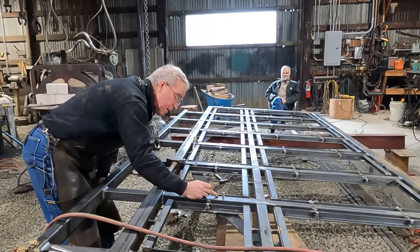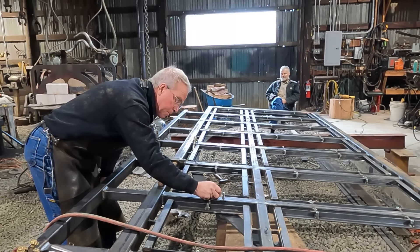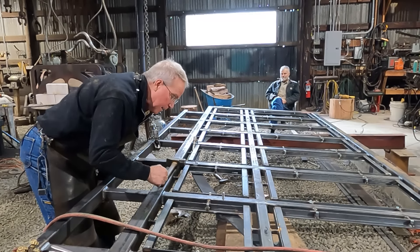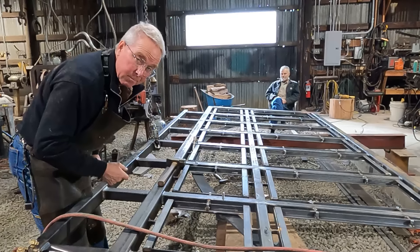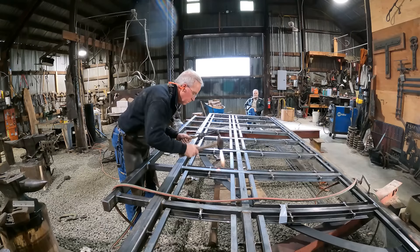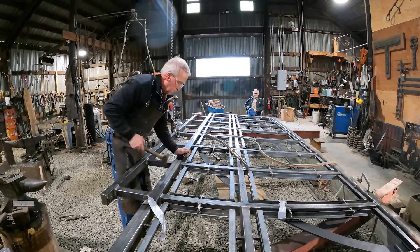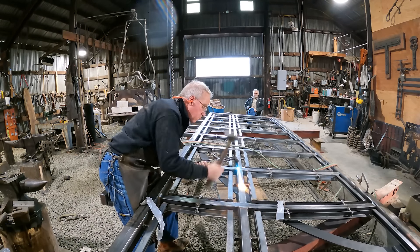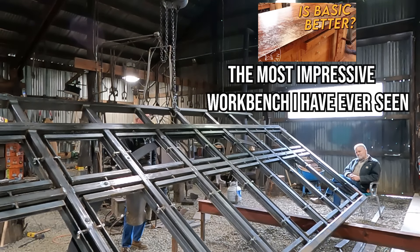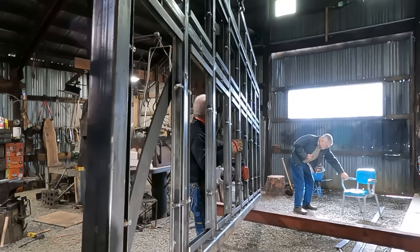Apparently this rivet didn't get cut to length — it's way too long, so I'm going to cut that off in place with my band saw. One and a half to two rivet diameters is what you use to create an appealing head, and one and a half is fine on this one. It's been a real pleasure to have Kenny in here with me. Fabrication is not his forte — woodworking is Kenny's forte — and as soon as this gate is installed I'm going to move into the woodshop, building a workbench like Ken's. Thanks for watching Essential Craftsman and keep up the good work.